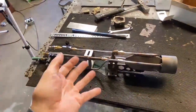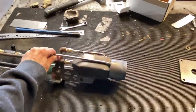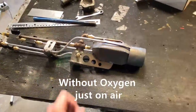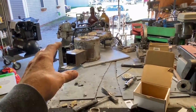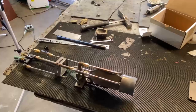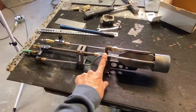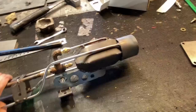I also noticed another event I wasn't very happy about. The device struggled to approach 2,500 degrees this time around, and I think I know why. The back pressure from the air compressor was as high as 125 PSI. We had a very long hose set up, and I believe the restriction in the nozzle is too high — it needs to be bored out. We were only running at 4 cubic feet per minute, and I have a hunch that 4 CFM in that space has a thermodynamic temperature limit. Last time I got one of these burners up to 2,650 degrees without oxygen lances, I had it hooked up to a massive air compressor with the hose charged to 135 PSI.